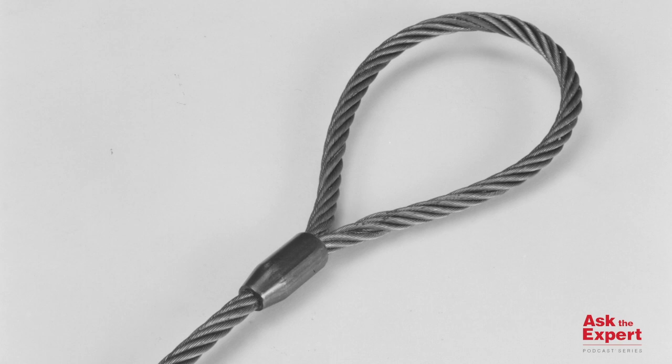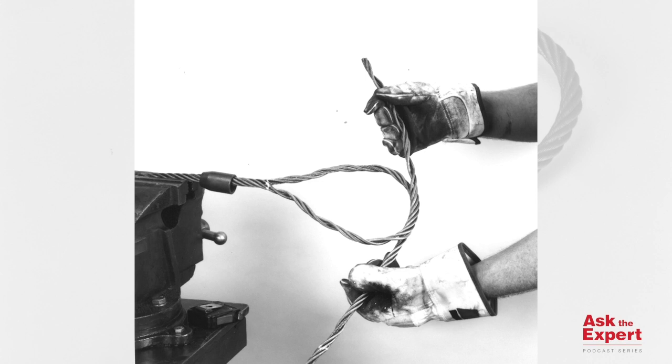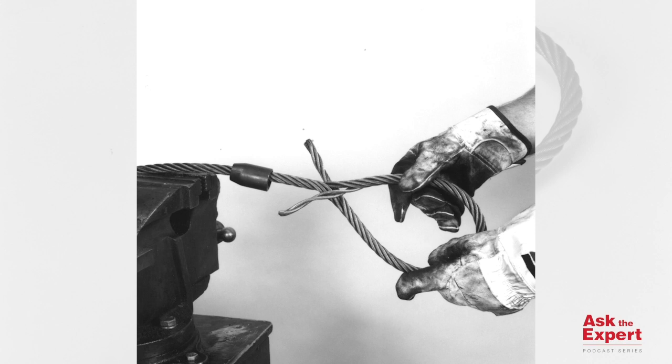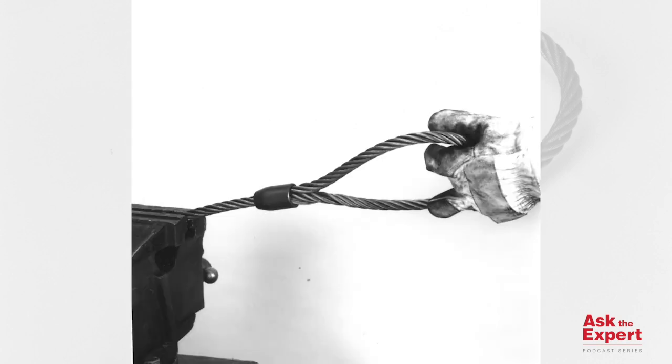Well Nabil, these two terminations you mentioned are the most common types used for wire rope slings in lifting applications. The Flemish eye is fabricated by opening or unlaying the rope body into two parts — one having three strands and the other having the remaining three strands and the rope core. The rope is unlaid to allow the eye to be formed by looping one part in one direction and the other part in the other direction, then laying the rope back together. The strands are rolled back around the rope body, and a metal sleeve is slipped over the ends of the splice and swaged to secure the ends to the body of the sling.